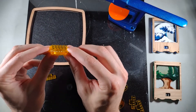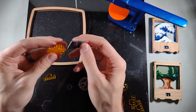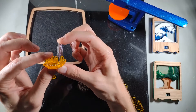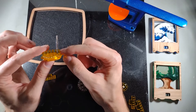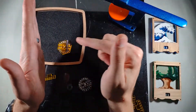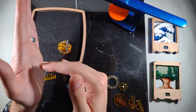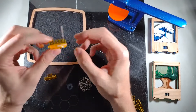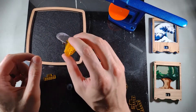We also ran into some tolerance issues with these teeth combs — you can see they're not straight up and down, they're at a slight angle. We're fitting a cardboard token in here, and cardboard tokens vary in size and get thinner with use. There's a straight front face and about a 5-degree angled back, so the average thickness sits in the middle of that slot. If you take a piece that's slightly thinner it'll sit higher up, and as pieces wear or vary in thickness they'll slowly go down further, letting you set your own press fit so the piece won't fall out.